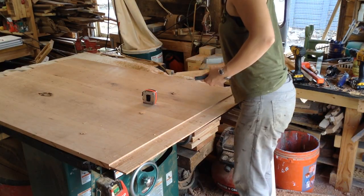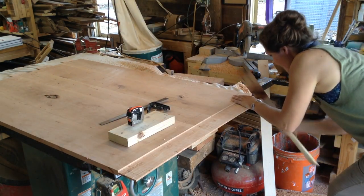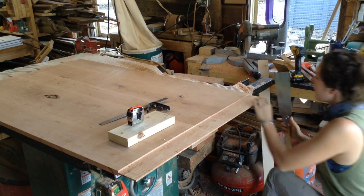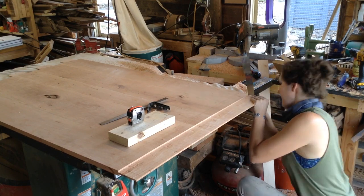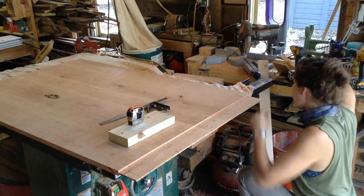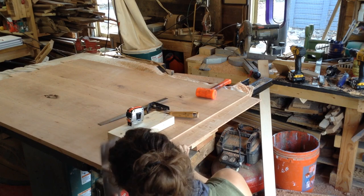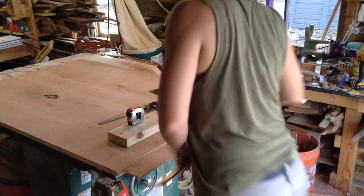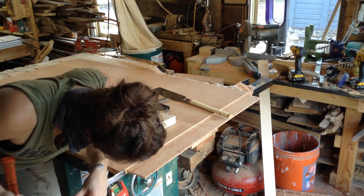So you do not want this entire piece to be connected as one long piece, because that wood will act as one uniform piece. Splitting it up into smaller 4-inch sections is usually the recommendation for the width of a tenon. After that, you should be breaking it up, so they won't be as subjected to changes in humidity.